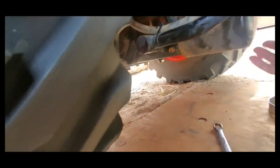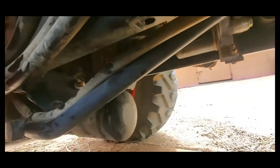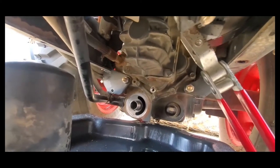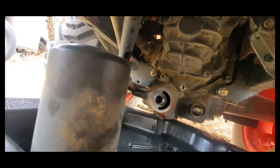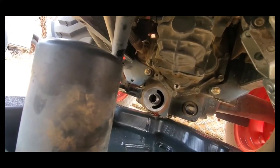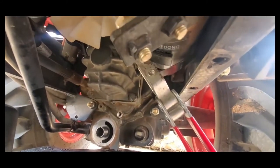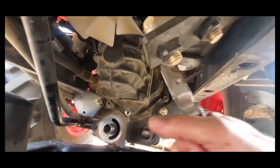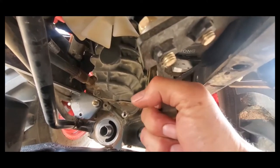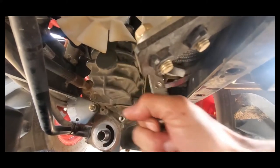These filters are painted in place so you have to push kind of hard to break them loose. Now that one's broke loose I'll get the drain pan back underneath and work on the hydrostatic filter. The hydraulic filter won't have any numbers on it because they paint these with the hydraulic filter already installed. The hydrostatic filter does have numbers still on it — they put that on afterwards. I'll break this one loose and then we'll go over which filter is which.